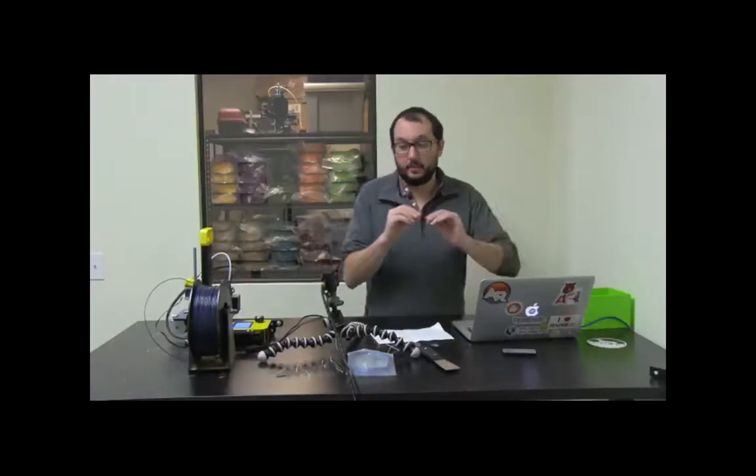So if you have a heated build plate and an enclosure, the heated build plate helps the print cool at a consistent rate, so that bottom layer won't warp up. And then having that enclosed space also helps it to cool consistently, because ABS is notorious for warping up on the sides and having some problems and issues. So if you're going to print in ABS, it helps, you don't have to, but it helps to have that enclosed space. But if you're in PLA, you don't. But that's why we love these so much, because they print in PLA, but they also print in any PLA composite too.